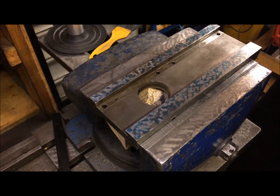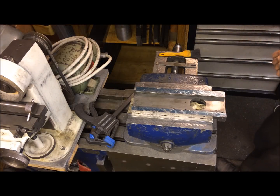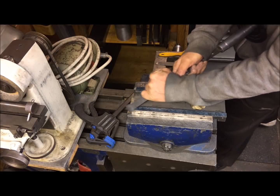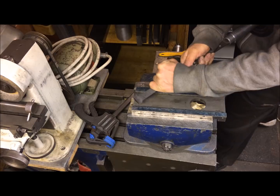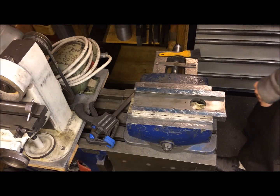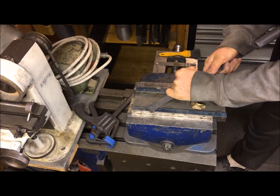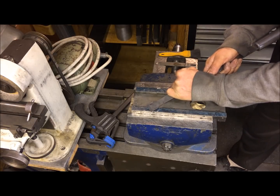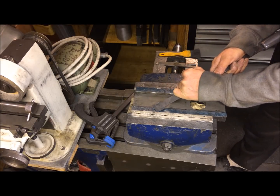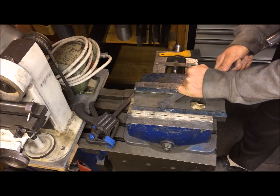Now I want to show you that it's a little bit trickier to proceed with the same technique for the actual scraping. Showing the different methods: first push and lift, same as we roughed, but you can see I don't get that short point, and I have problems getting that consistency for individual points and rows. If I go with the other method — the normal body push — it's much more easy to be consistent and to get those individual rows and points.